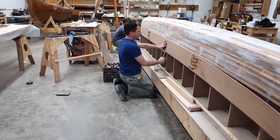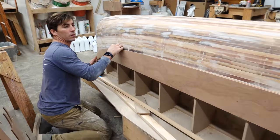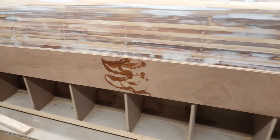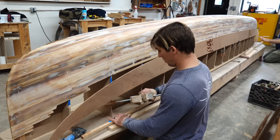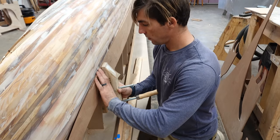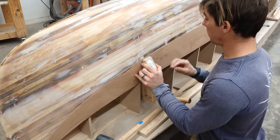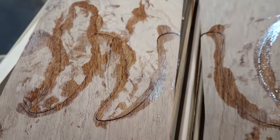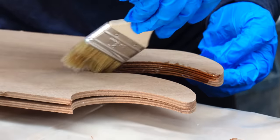The first step for today is to install the shear panel. This shear panel is made out of beautiful sapele marine plywood. This plywood, just like any other plywood, comes in 4x8 sheets, so in order to get the 20-foot-long shear panel we had to glue multiple pieces together in length. CLC cut the multiple pieces out on their CNC machine and included puzzle joints in these pieces, which you saw us glue together in the last video.